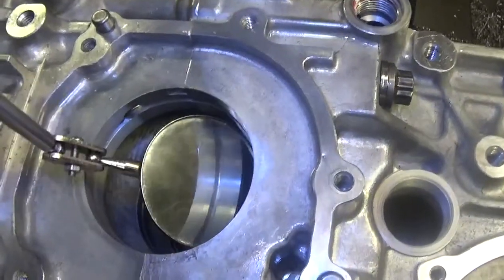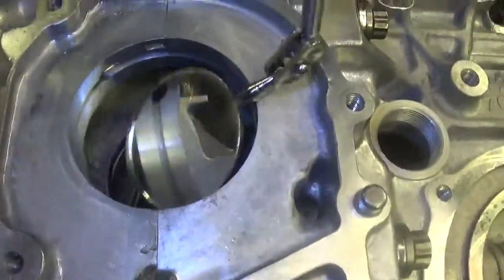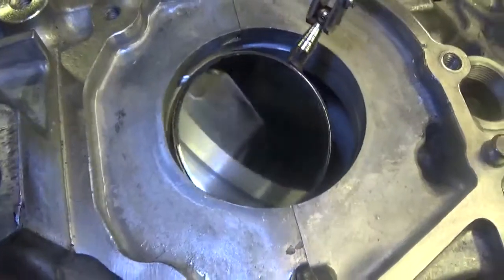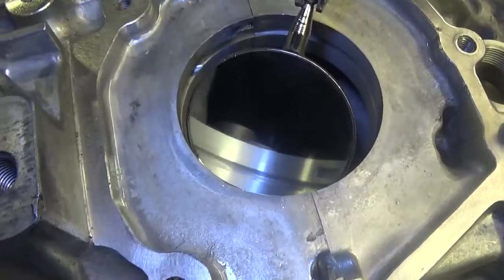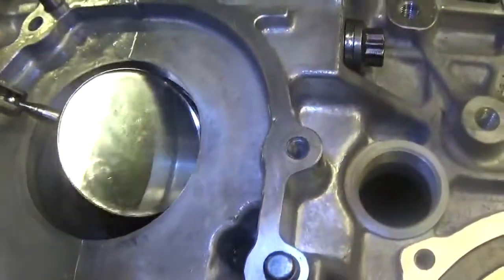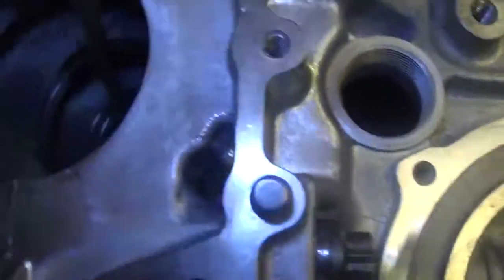You can see where it's a little shinier spot in the middle. I've taken a cut. Because this hole is smaller than the original dimension — I've shaved six thousandths off each case half — we're still not the size, so it's split evenly between the two halves. I'm just showing you that the boring bar is centered.